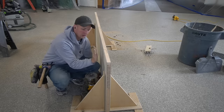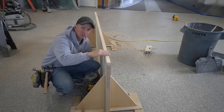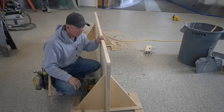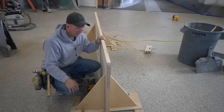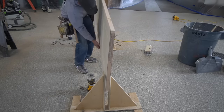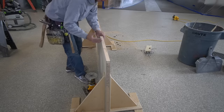It tapers up a little bit so I can drop the door down — the weight of the door flexes that half-inch plywood down and locks the door in place so it's not going to wiggle around. Whenever I want to lift it out, taking the weight off unlocks it and you can very easily drop it in and take it out. I didn't have any carpet to apply to the inside of the plywood, but I did ease all the edges so it's not going to scratch anything. These work great for dropping a door in and easily finding the opening.